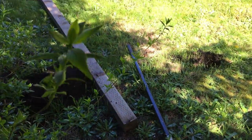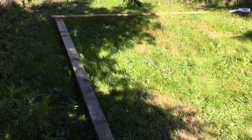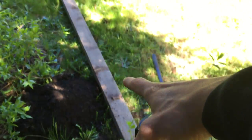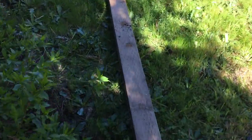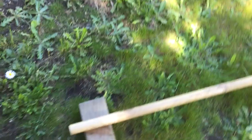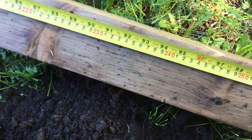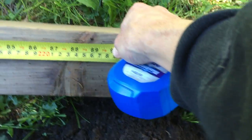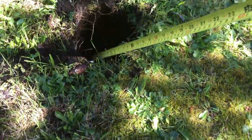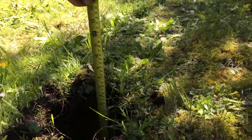Now that the hole is coming along and getting deeper, we want to measure to see how deep it is. These posts are ten feet long — I know I want seven and a half feet above ground, so that leaves two and a half feet, but there's a little bit at the top you've got to leave. I've got mine four inches down from the top, so to avoid all the math I'm measuring 90 inches — 230 centimeters — and marking where the soil needs to come up to. That mark is 26 inches, so that's how deep the hole has to be. We're at about 14 inches — keep digging.